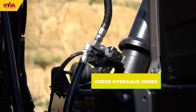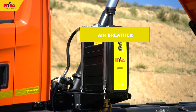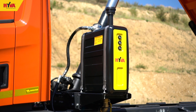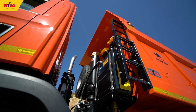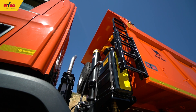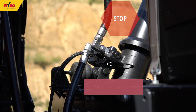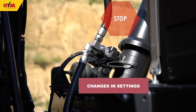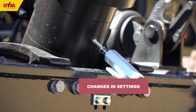The oil should be changed once a year if using the vehicle in a typical 40-hour-per-week operation. Replacement oil should be suitable for the hydraulic system and its operating environment, in particular ambient temperature. Oil should not be replaced if the tipper body is raised. Pressurized hydraulic systems can be dangerous; it is therefore critical that the hydraulic system is only serviced and maintained by competent and qualified personnel.